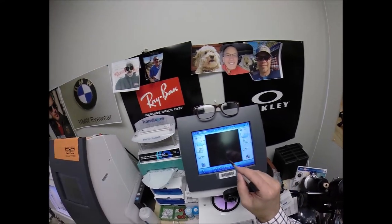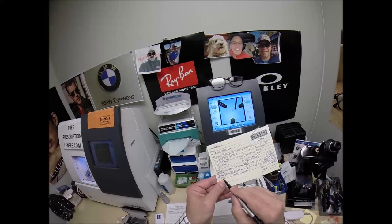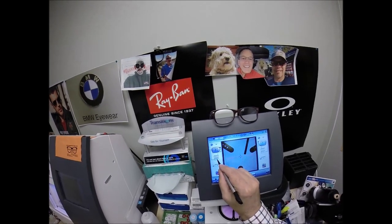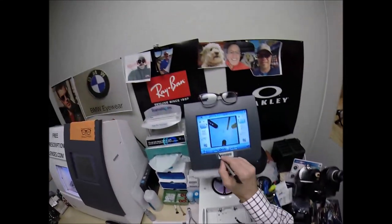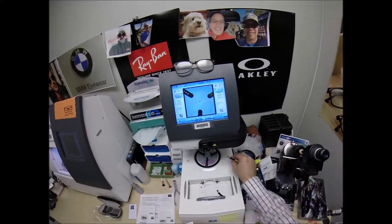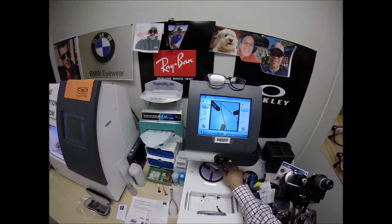Now that's the shape I'll be cutting. We're going to move on to the next screen to enter your pupillary distance and height of the progressive. Your PD is 62, divided by 2 is 31. The computer starts at 32.5, so I'm going to tap the minus button until we get to 31. I want to raise the optical center height up 3 millimeters and change the layout screen from single-vision to progressive.